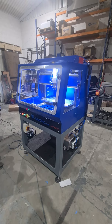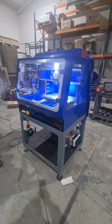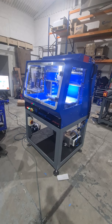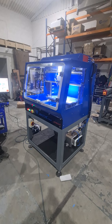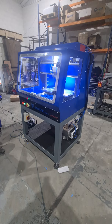One thing we're looking at is making an automatic tool-changing version — the machine will obviously be bigger to fit the ATC, but it should be a lovely thing when it's done. I'm also going to change the cabinet style. The base of the machine — how it's built and designed — we like that setup; it's very strong and rigid. Electronically, the controllers and motors are rock solid; we've proven those for years across all our other machines, so we know they're top class.